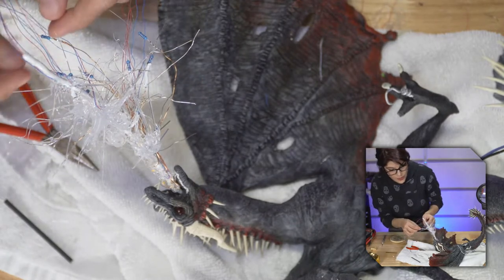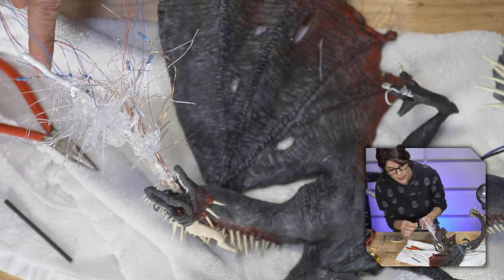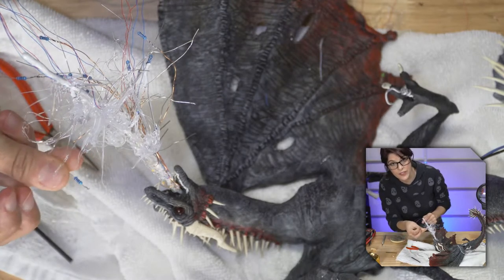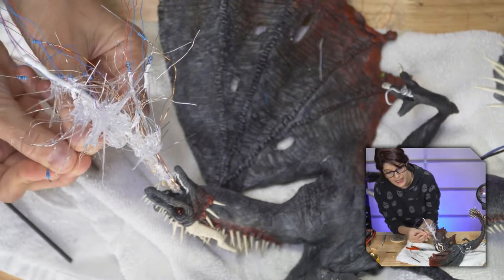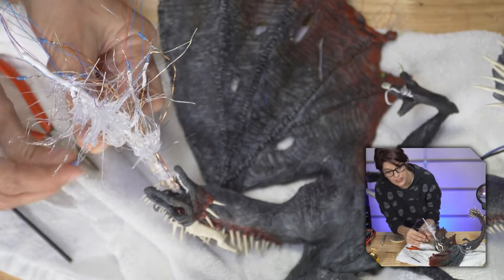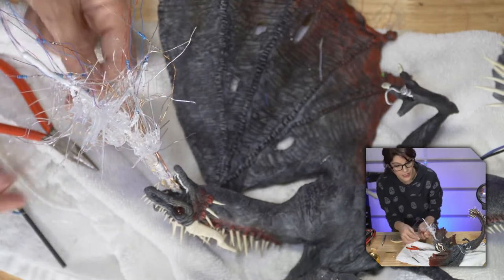One of the things I did with putting the resistors on the ends was I wrapped the resistor further up onto the insulated part to make a really long joint. So we have metal to metal, and then the resistor continues winding up on the insulation, just so we don't get this problem. I know exactly where this came from: there was a wire that didn't have an uninsulated portion. I took sandpaper and sat here sanding off the insulation and then put this on, and yep, sanding off that insulation definitely weakens it. So this one may not have a resistor until much, much later in the process.